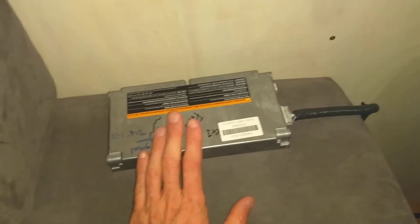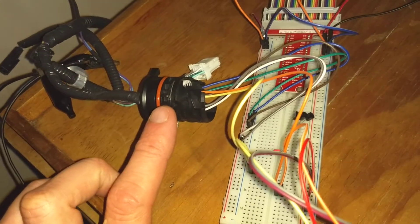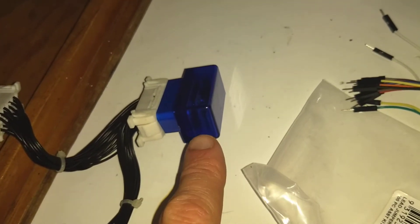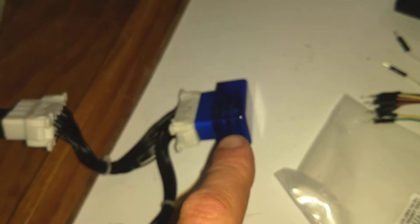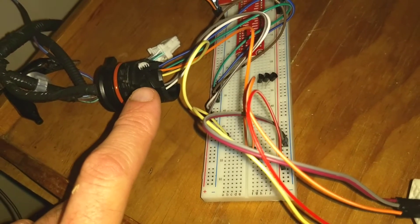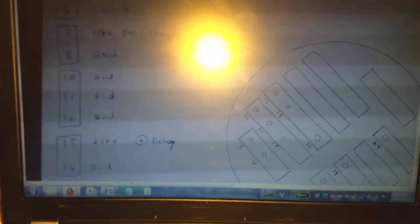This is the computer from a Nissan Leaf battery, attached to a wiring loom also from a Nissan Leaf battery, and this is the connector that would normally come out of the battery. I've got it wired up via a breadboard to an OBD2 Bluetooth thing, which I'm hoping to use this phone here to interact with the output of that. So I guess you're not going to find in this video whether it worked or not. This has been wired up according to the pinouts worked out by Wolftronics, who is an uber geek — so there's his pinout diagram for the Leaf battery.